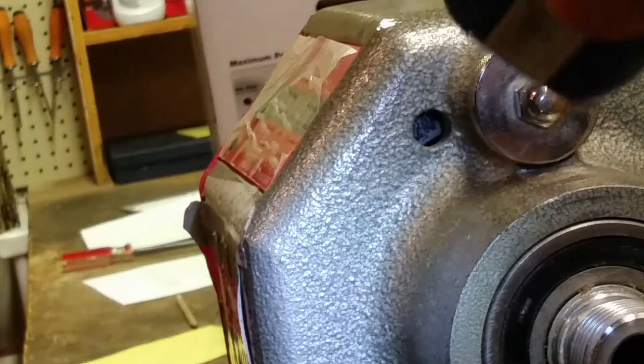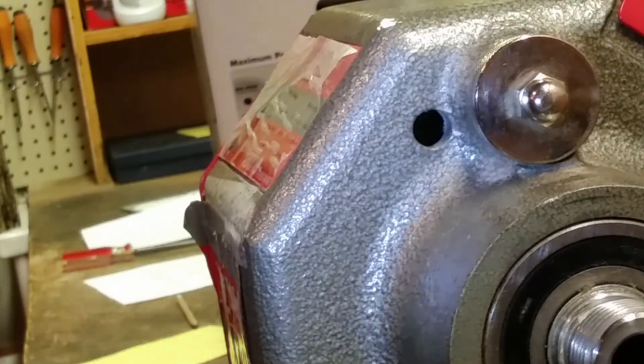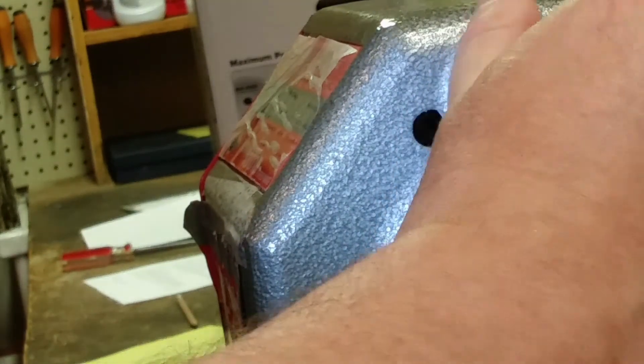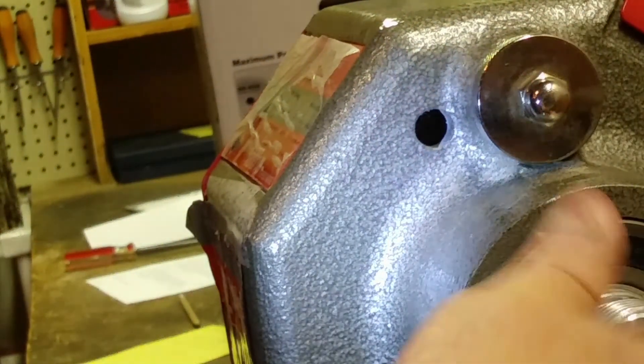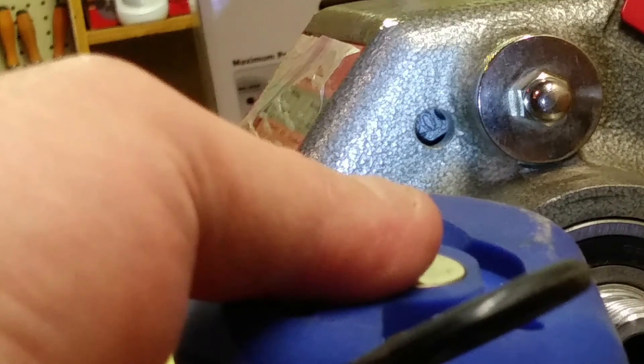It's funny, because by taking the machine apart and reading the instructions, this is the only way I ever realized this small hole near the center of the lathe. I would have never known what was inside of it if I hadn't done one or both of those things. There are 24 notches in here that can be seen if I flash a light inside — each notch has a number on it. Since it goes in a circle, each position is 15 degrees from the previous or next position. When I turn the center, it turns a dial inside as well. A person could manually turn the center to lock something in place in increments of 15 degrees. It's called a spindle index. What I don't understand is why — I have no idea what this would be used for, except perhaps to do detailed graphic work on a project by drawing straight lines along the spindle or something.